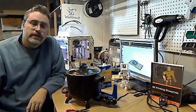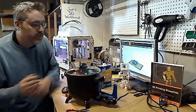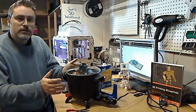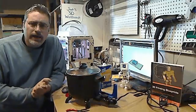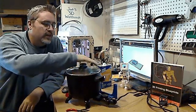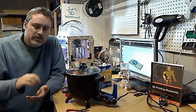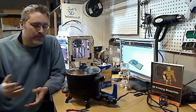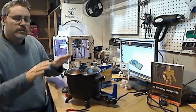Make sure you're doing this in a well-ventilated room. Your printer should be in a well-ventilated area — I don't care if you're using PLA and it smells like cotton candy, ventilate. Always ventilate. So that's all there is to it to using the vapor pot smoother — just get yourself a cheap steamer pot with a basket. I have found a problem with this particular basket where the prints seem to stick to it, and when I pull it up, there's a strange coating sitting on the print. My lid has just got nice and foggy, which means the whole thing is full of vapor — and that's fantastic. Now that it's all filled with vapor, I'm going to turn it off and just let the heat do it.